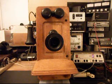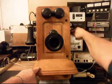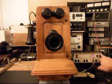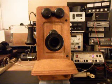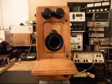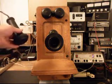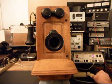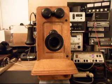We'll ring the telephone with the crank one more time. And then we can go ahead and use the analyzer to ring the telephone like you were getting a call. We'll let that go a few times. Give you some dial tone. Now we can move the telephone line over to a regular line, and we'll call a time and temp number, and we'll use a tone dialer since this telephone does not have a keypad in it.